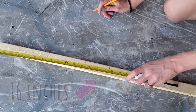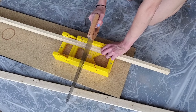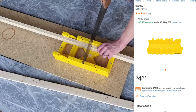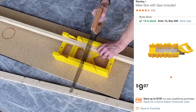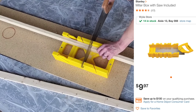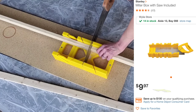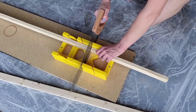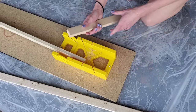I'm cutting my ladder down — I don't want it a full eight feet tall, so I measure down 16 inches and cut that off. You don't need any power tools for this; all you need is a hand saw, and it helps to have a miter box. I also have a hand saw and miter box combo linked in the description.